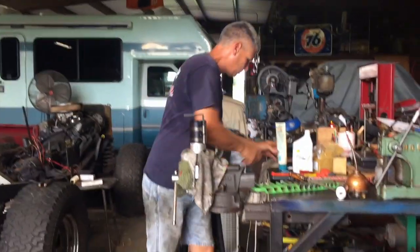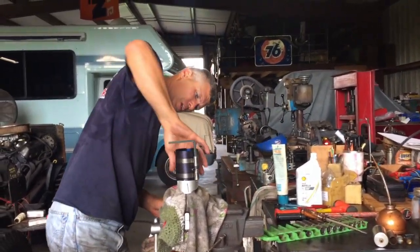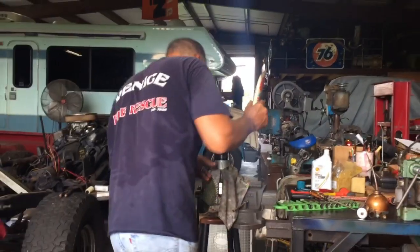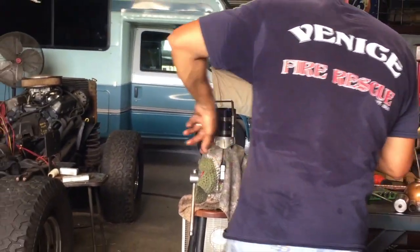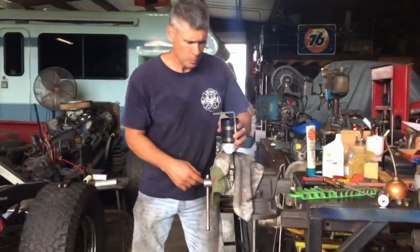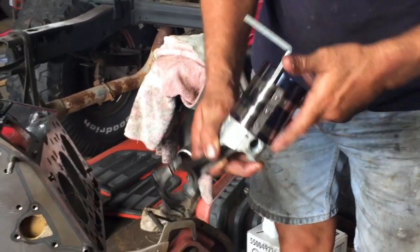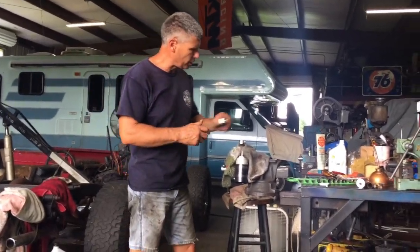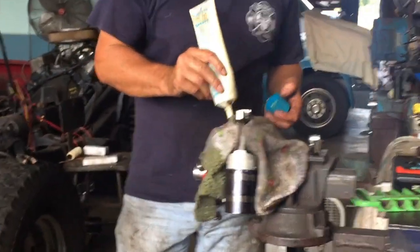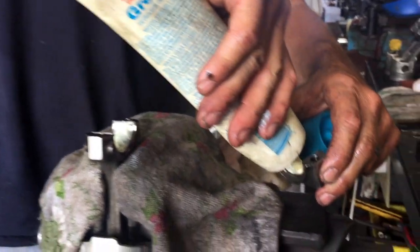Okay, now I lube the mess out of the pistons. I lube them real good because I want to slide in, you know, with as little effort as possible. You need to make sure you're oriented properly. And on this one, it's the little arrow on the piston goes towards the injector pump side, and the intake valve is forward. Getting our bearings set in here on the connecting rod. And there it is. Always a little bit of engine assembly lube or motor oil, worst case. Kubota only specs out motor oil, so whatever you want to think about that, it's fine.